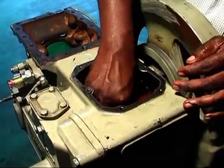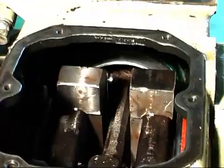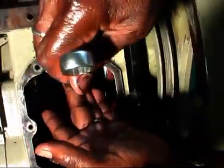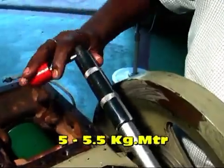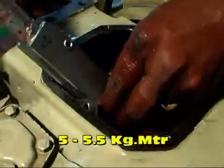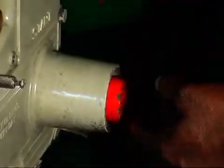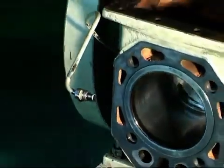The batch number on both the halves of the connecting rod should remain matched. The batch and oil hole of the connecting rod should remain on the upper side. Please check the function of oil circulation by cranking. It will let you know whether the oil pressure is okay or not.